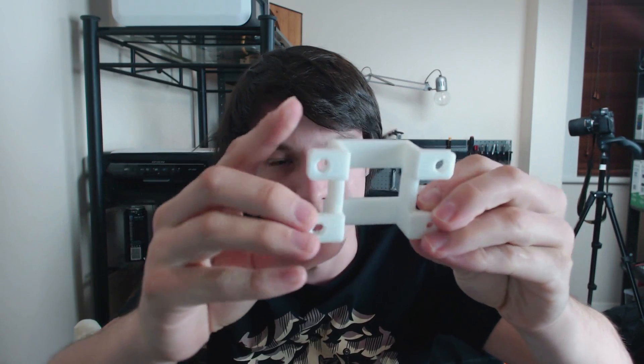All righty guys, well here it is — it's done. It took about an hour on the UP Box and there was no warping whatsoever despite being ABS at 100% fill, which is really quite impressive for getting dimensionally stable parts. So let's pull the support off. It generated support on that middle part and between the tab bits, but not through the middle obviously because it didn't need it. I'm doing this with my hands — might need to use pliers to get in between the holes. That's the part with all support material cleaned off.